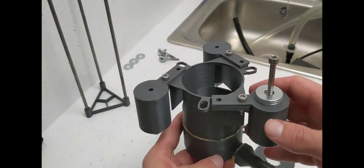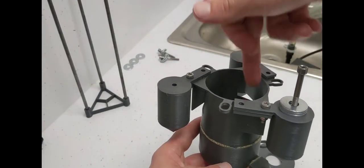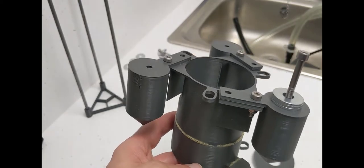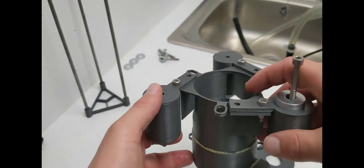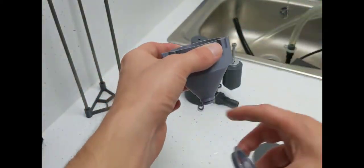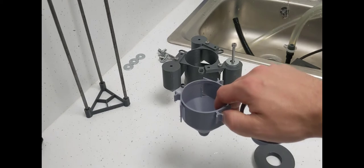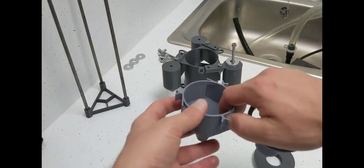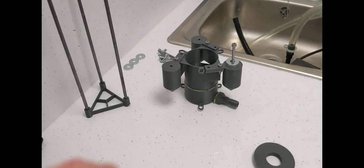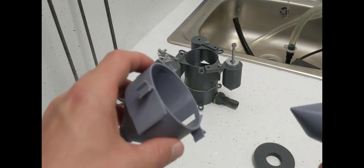I played around with sizing and arrived at what gives a good vortex and good suction. Make it too big and the vortex gets weaker; make it too small and the pump is working too hard without enough volume. I also tried a version with the spout coming out of the bottom, but it didn't go low enough in the tank — when the level dropped it stopped drawing coolant and started cavitating. Once the pump starts cavitating it won't stop until you turn it off, let the air work through, and turn it back on.